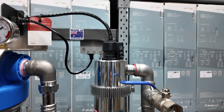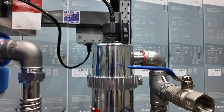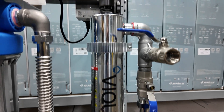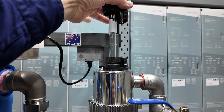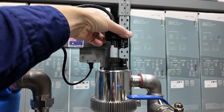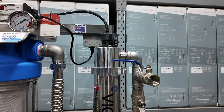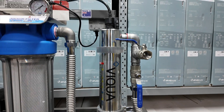These chambers are made in Canada — extremely high quality, stainless steel, really strong, really thick metal. They come with a 10 year warranty. Inside the chamber you'll have a UV lamp. The UV lamp is what glows and kills all of the bacteria, or basically deactivates the bacteria in the water and stops them breeding in the water and making you sick if you consume the water.